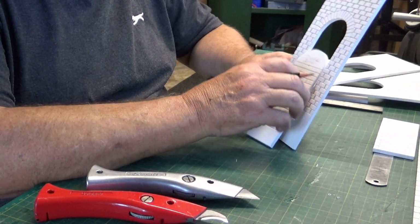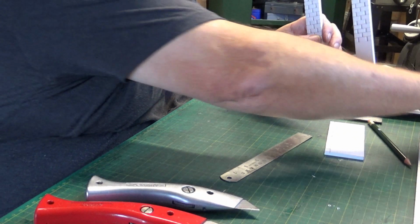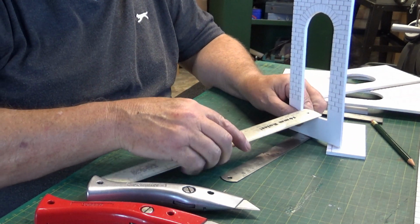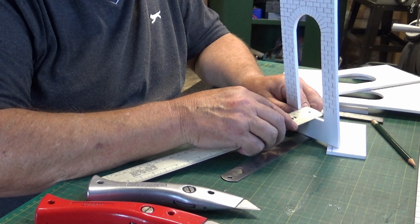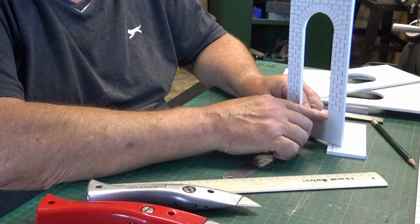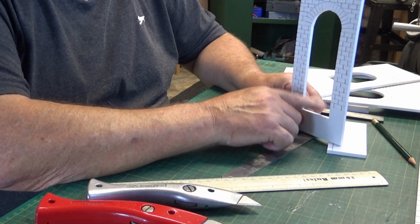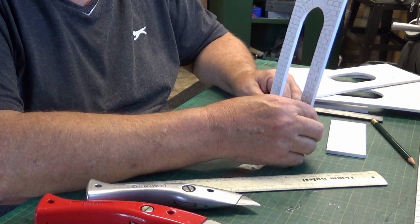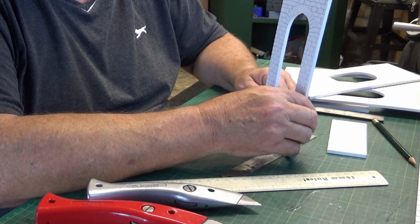But once you've got into it, 5mm will give you the definition, which is, if you look on there, 5mm divided into there is approximately 4 inches deep. So it's virtually a brick width. That's how I look at it. If you did 3, it'd be slightly under. So when I'm doing brickwork, I stick to 5. Anything other than that, I'd probably use 3.